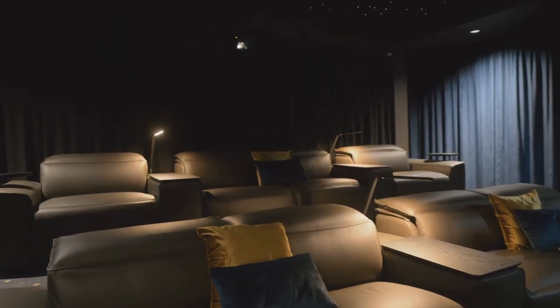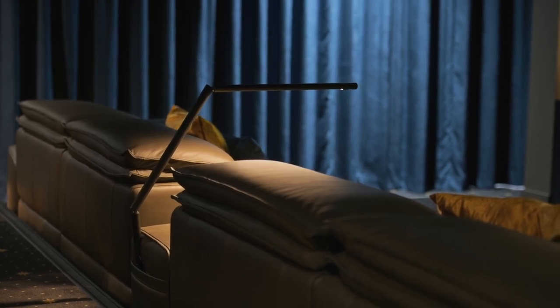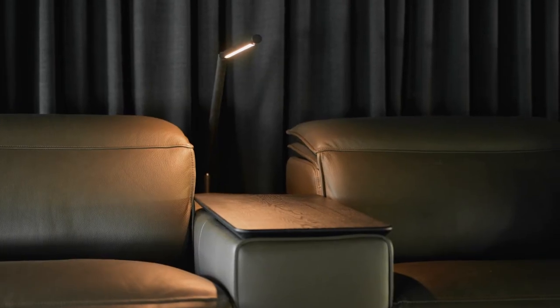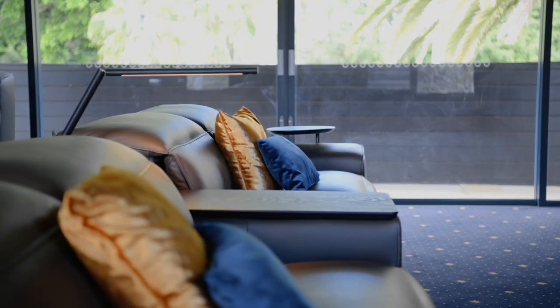One of the most important things in cinema design is starting with seating placement. We've done a large enough platform to bring the front row forward and give access to the back row, and importantly the back row of seats is not against the back wall — all sound frequencies load against the boundary. By pulling the rear row off the wall and placing speakers and curtain behind it, the head position sits around 1.1 meters off the back wall, so most boundary effects don't come into play during calibration. The result is that the EQ settings, SPL settings, and time alignment settings are very similar for both rows, so you get consistent performance quality whether you sit in the front or rear seat.